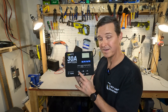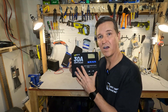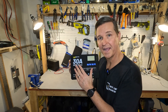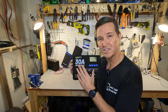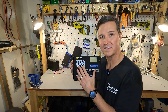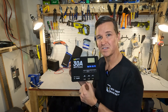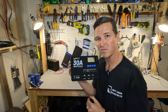After that you connect your solar panels, just make sure you're not using over 100 volts of solar. Knowing that this thing can deliver 30 amps of electricity to your battery, if you have a 12 volt battery bank you're going to be getting between 360 and 400 watts, and if you have a 24 volt bank you could just double that — so between 720 and 800 watts.